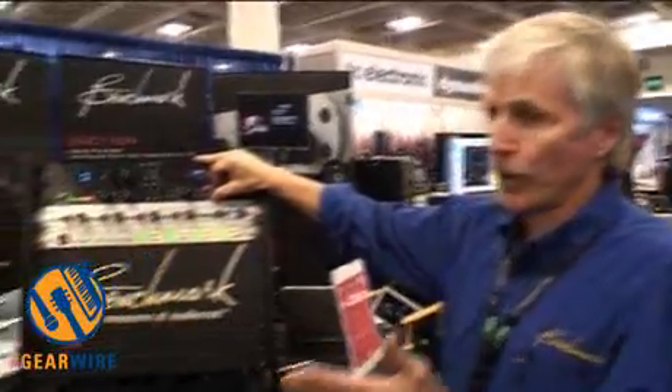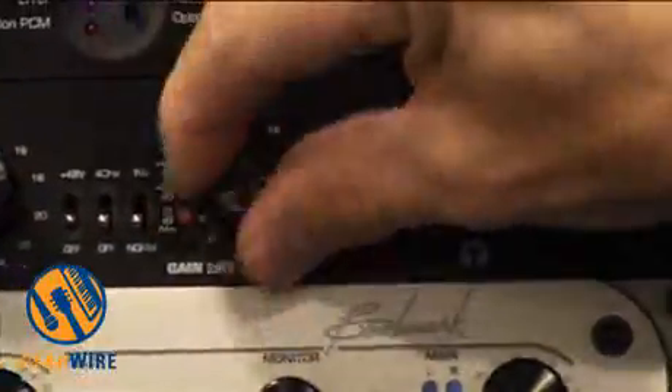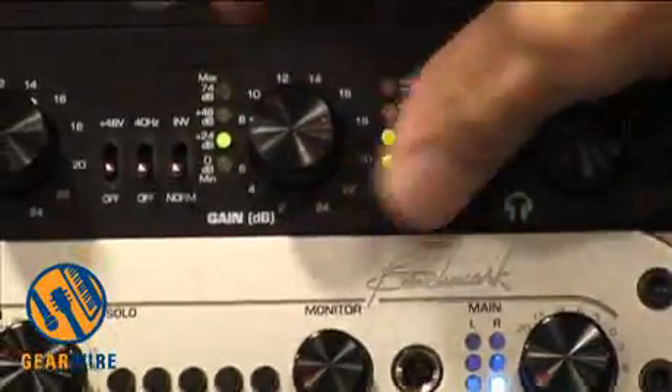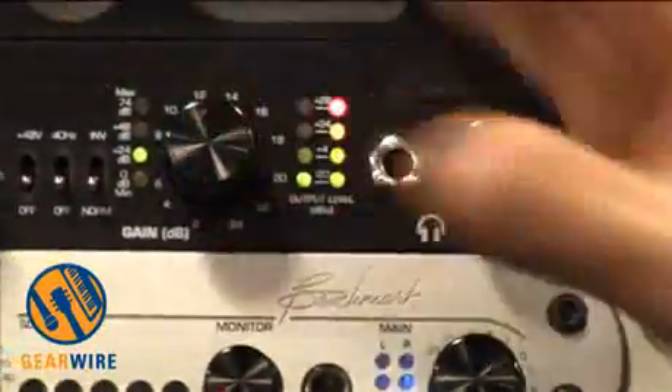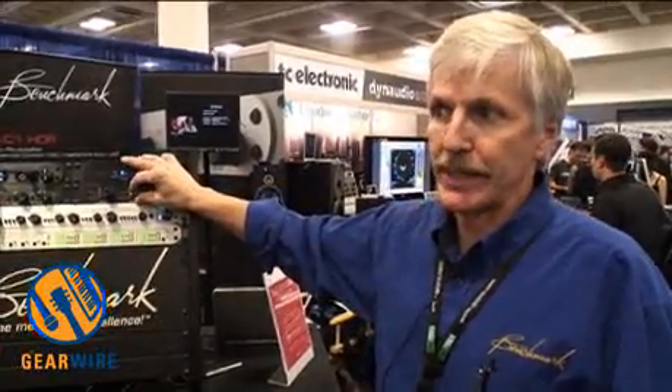As we turn, there are relays that move us from one deck of resistors to the next. The advantage of doing that is twofold. First of all, our right and left gains are exactly matched throughout the entire gain range. But more importantly, the noise performance is optimized at all gain settings.